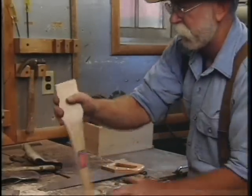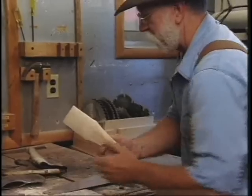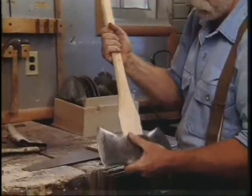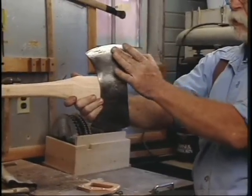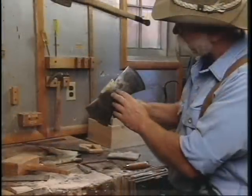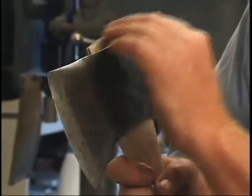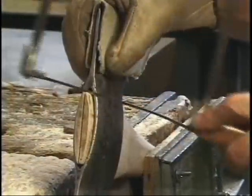Take a look at it here. Time to try it again. Put it back on — now it would be a good time to sight down it. Looks like the edge is in line, so it's going on square. Now that we've driven the handle all the way home, you'll notice the edge is a little bit uneven on this side. If you remember, we just cut this off rough. The important thing is that it's square here and that the edge is in line with the handle.